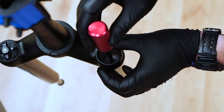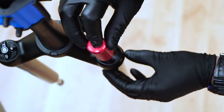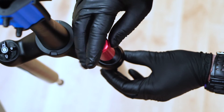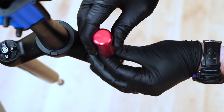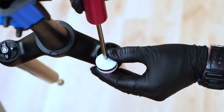From the top of the left leg, the air piston can be removed for service. Either push the piston down through the bottom of the leg with a long dowel rod, or thread an M6 by 1 by 50 millimeter bolt into the top of the piston and pull it out through the top of the leg.